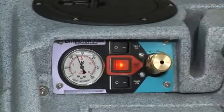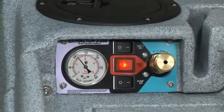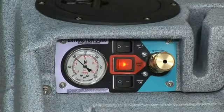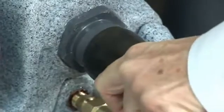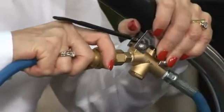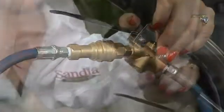Now that liquid has filled the heating tubes, turn your heater on and let dwell for 2 minutes, allowing the temperature of the heater to rise to its maximum 200 degrees. Connect the vacuum hose to the male barb on the front of the machine, pulling left to right as you push. Follow the same procedure on the carpet wand.